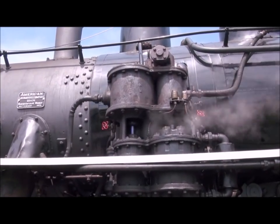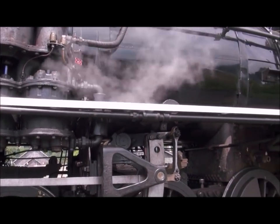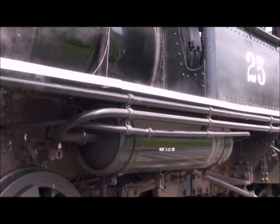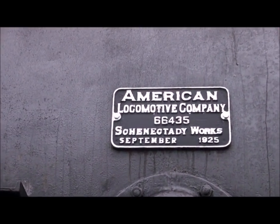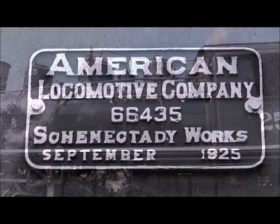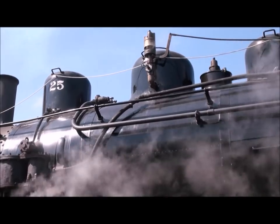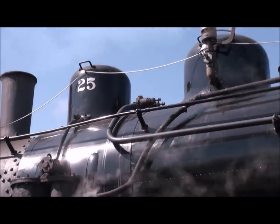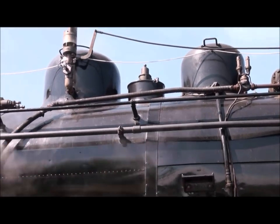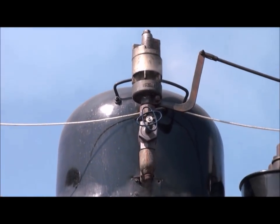The compressor is operated by steam. We don't use steam in the brake system because of all the moisture — what we do is use the steam to pump air up. This is a builder's plate — all steam locomotives have one that tells you a lot about them, where they came from, when they were built. On this particular locomotive there are three domes on top. The front dome has sand, which we put on the rail anytime it's slippery. The middle dome is the steam dome where steam is collected. And the after dome has sand in it also, in case we're going backwards. And of course, don't forget the whistle. That's a basic little introduction to the outside.